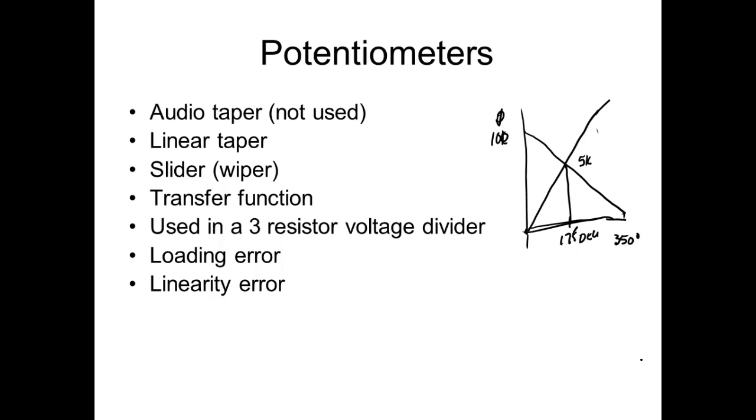So what you're doing with a pot, you got three options. You got one where you can make it act like this. So if I measure across this, what's it going to measure? It's going to measure the applied voltage, right? You understand. You got another way you can set it like that, and it's just going to act like a wire. So what would I measure across that? What would you measure across a straight piece of wire? Zero. Or I can make it do this.